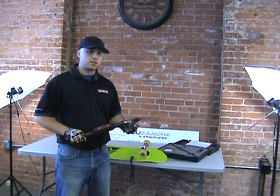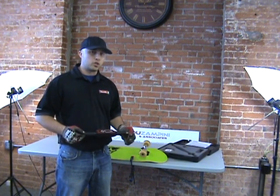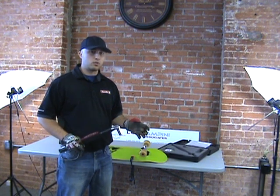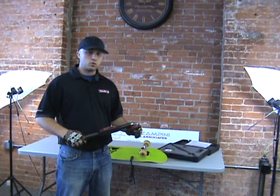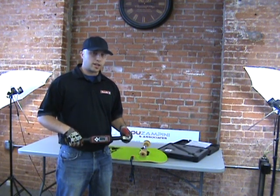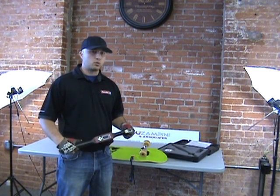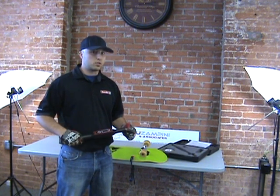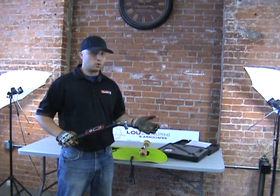What makes that nice is if you're using air tools in your operation and you all of a sudden have an increase in your accuracy requirement, you can go ahead and use this wrench for either final tightening or for your quality control check afterwards to verify that you are within plus or minus 1% of the torque required for your application.